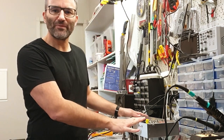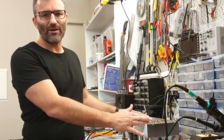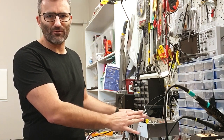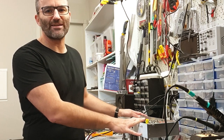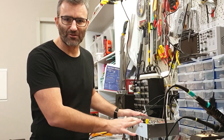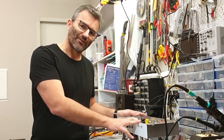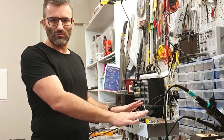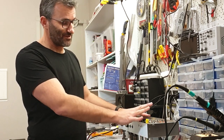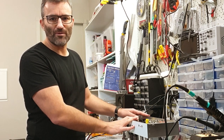What we're going to do in this video is rebuild the front end of the amp, the preamp, and change the preamp from this JTM45 configuration into a JCM800. And in doing that, add a gain structure switch, which changes the setup of the cathode resistor on the second gain stage. This amp will basically end up like a dirty Shirley, which is a JCM800 front end into a JTM45 power stage.